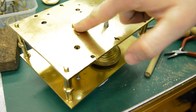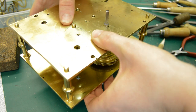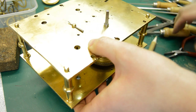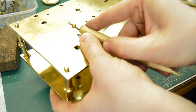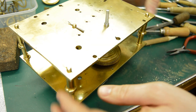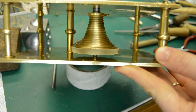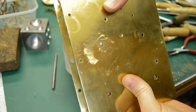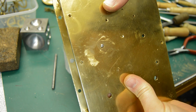Now it's important on a five-pillar clock to always pin the centre pillar. It's tempting when working on the clock to only stick the four pins in the outer pillars, but when you're assembling the clock and you put the fifth pillar pin in you get a nasty surprise when all the end shakes tighten up. Here's the fusee running nicely between the plates, standing upright — everything's parallel and as it should be.